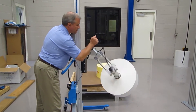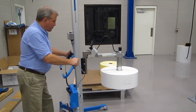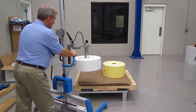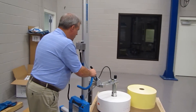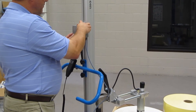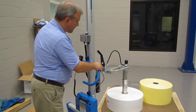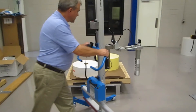I'm going to take it back over again, release the brake, and put it back on the pallet, then go over and pick up the other roll in the same fashion. I'm going to press two buttons — you'll see the red light come on — and that releases the expander from the core. I'll use the two-button remote to pull the expander out of the core, then take the lifter to the other side of the pallet.